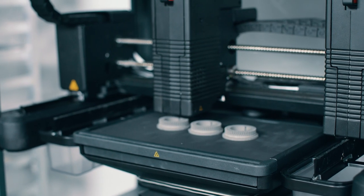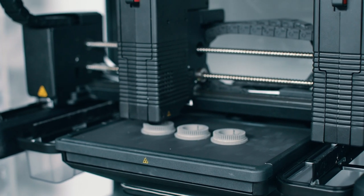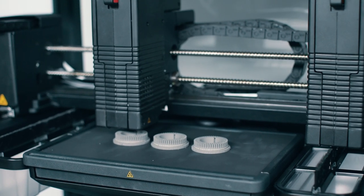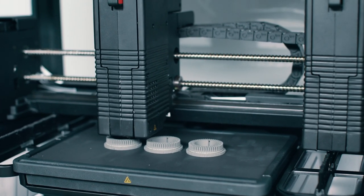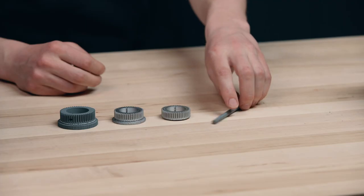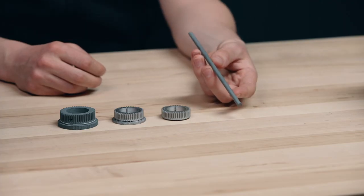Let's go ahead and take a quick look at how the printer works. The printer is very similar to a plastic FFF style printer — media is extruded through a nozzle, and the part is printed layer by layer. However, instead of using plastic filament, the Studio System heats and extrudes bound metal rods. This rod is a combination of metal powder and binder. As the rod is extruded, the binder is what's being melted, and the metal powder just comes along for the ride. The binder acts as a medium for the metal powder to be laid down in the correct locations for the part to be printed layer by layer.